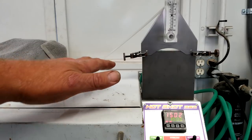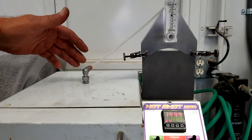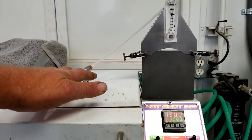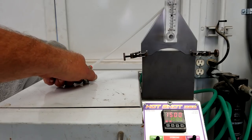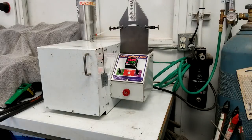After this we'll pull the parts and make sure the setup works with the ports, and make sure our probe is going to live hanging down in that chamber — staying cool and not building up carbon. It's 316 stainless but it can still burn out the little carbon in there and make a mess if it overheats, causing it to stick in the fitting. Then we're going to take the whole thing up to 2000 with the same flow to make sure it makes temperature. It's been two hours now — I'll bring you back to quench the parts, check the scale, then add another 500 degrees.